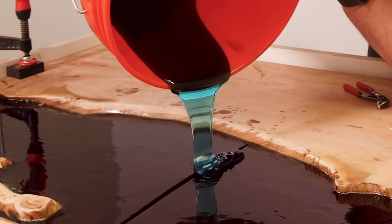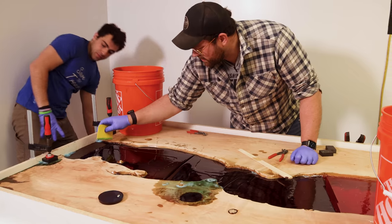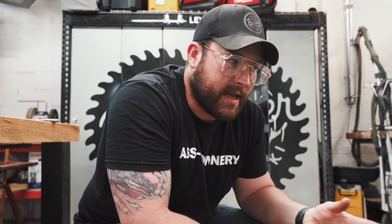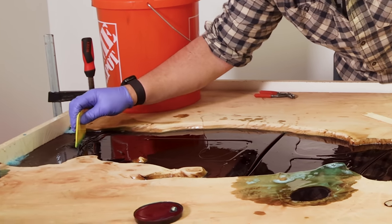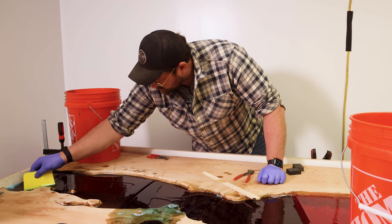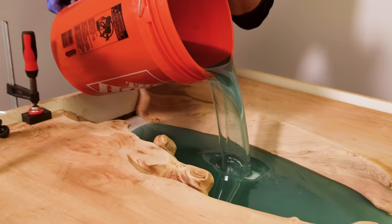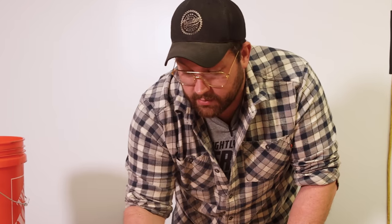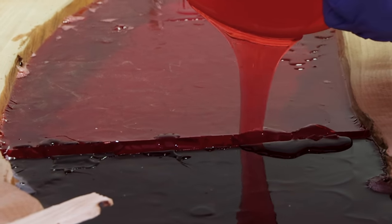To Sam's point, when this happened on the waterfall table - thermal heat from the inside creates a swirl inside the blue. I can't replicate that if I just fill the cracks with a similar color blue - you'll still be able to see them. We were trying to do a pigment we didn't pre-measure and had a couple colors that made things not work. But these are the exact mix - it's just the next day when you're not supposed to be working it. There's no chance these bubbles are coming up. I went into full screw-you-table mode and just sent it - turned the AC off, said you want to get hot? You're going to burn. This could either save it, or we're potentially going to be scrapping $4,000 worth of epoxy and wood. It's not what I wanted, but it's improving slightly. This might work. I think the red will look actually solid - the blue I'm really worried about.